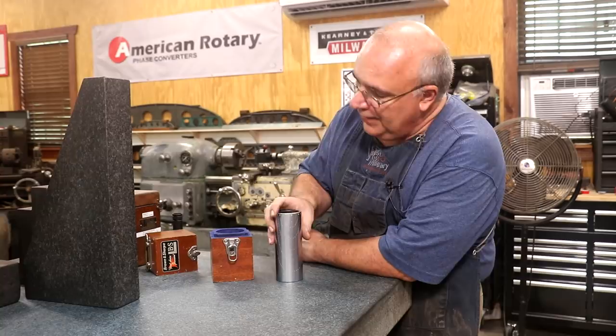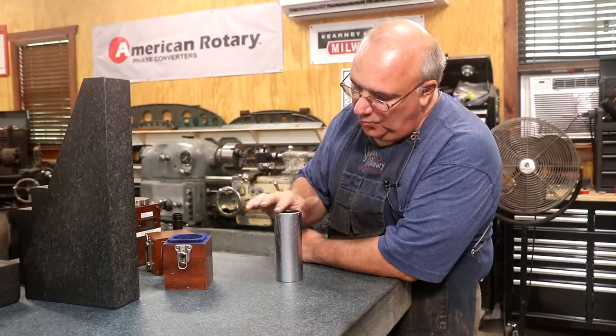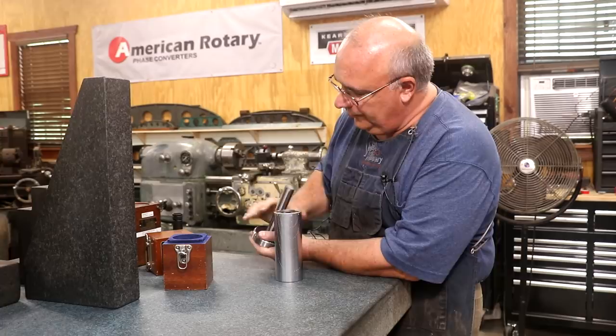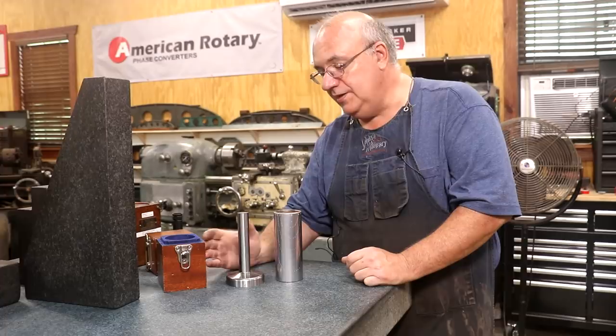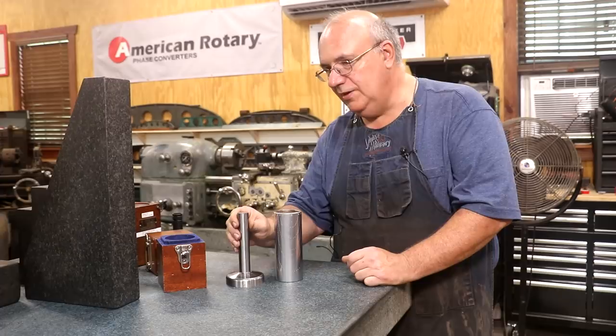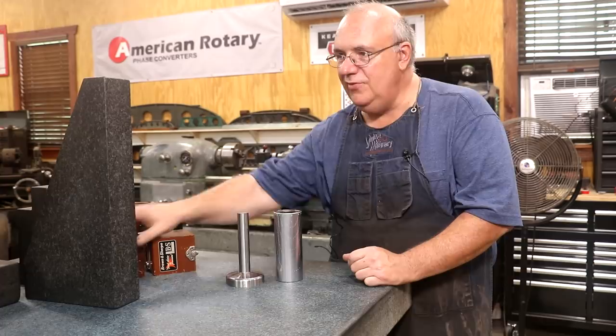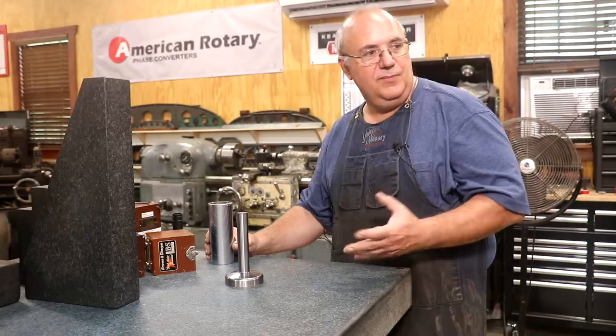Really handy tool. When you talk about cylindrical squares, you can get a normal cylindrical square that doesn't have this tilt mechanism in it — much more economical, and it's a very handy tool to have. I've also got this cylindrical square, one that I've had for a long time. This is one of the first tools I actually bought when I was really getting into the machine shop stuff, and I got it for tramming my milling machine head in, but I've used it for so many things. This is also a cylinder square — it's a smaller cylinder. The big base down here is magnetic, so you can stick it onto a surface and it just sticks right down.